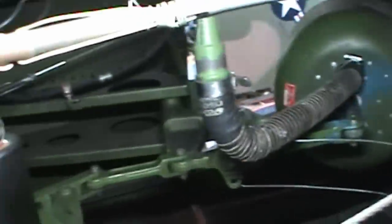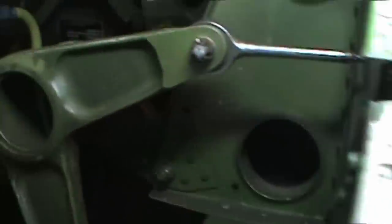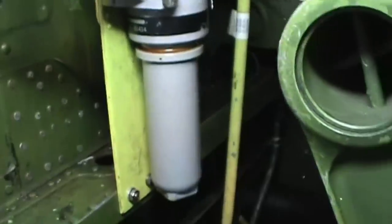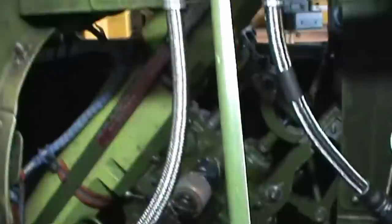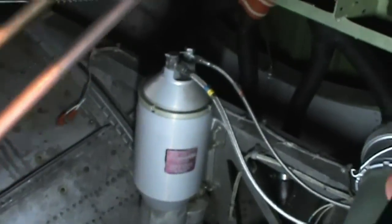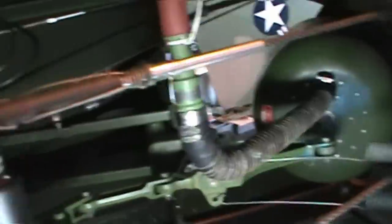There's a lot going on in here — you can see there are a lot of cable-operated controls coming to a lot of the hydraulic actuators and assemblies. There's another hydraulic filter there that we pulled a few weeks ago, and then there's more of the rudder and tail activation assemblies. Right down there you see that bottle — that's part of the actuating assembly of the tail hook. Ahead there are some fuel lines, likely for the afterburner.